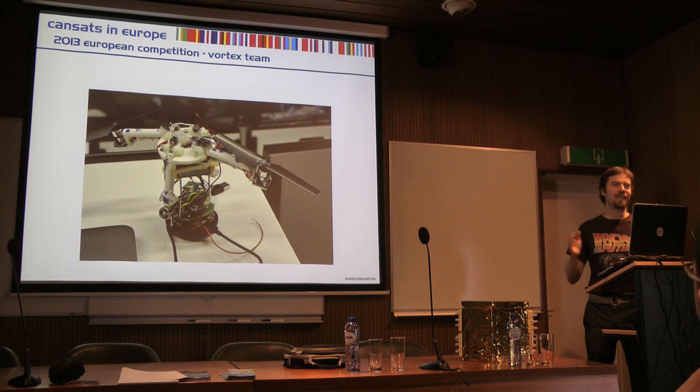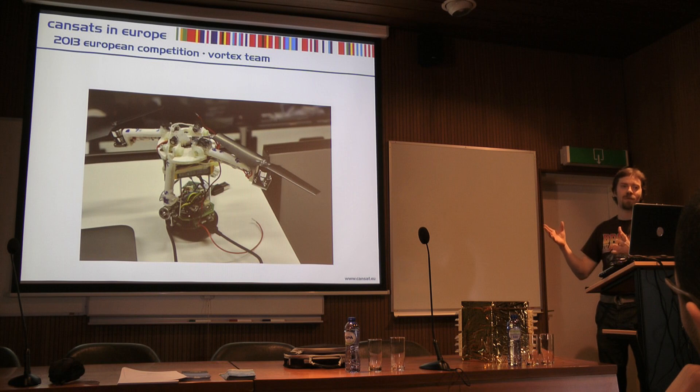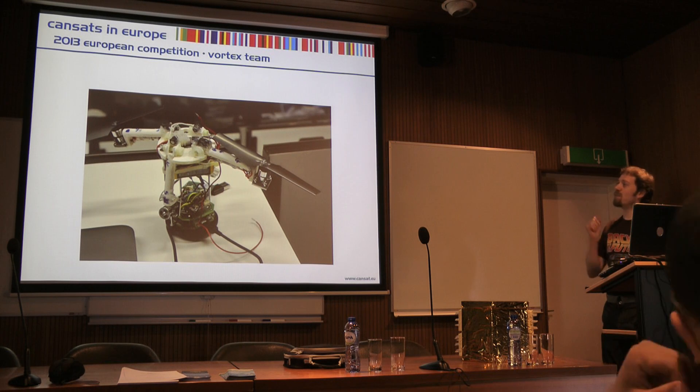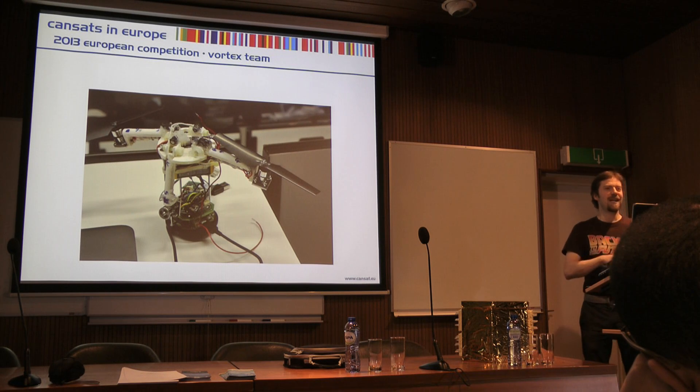After our presentation, we were given a long list by the ESA judges of what we had to do to make it compliant — basically they weren't going to let it fly if it stuck out, as it wouldn't fit in the rocket. If the rotors deployed they could bring the rocket down or disrupt the flight for other CANSATs. We had to add a safety switch so it only deployed after leaving the CAN; they suggested a start switch pulled by a parachute. So we had to add a parachute, a start switch on top, and reposition all the electronics. After doing all that, we tested it at full power — and at about 4 o'clock the day before the launch, it all seemed to be working, but the hot glue wasn't strong enough and the rotors flew across the room.